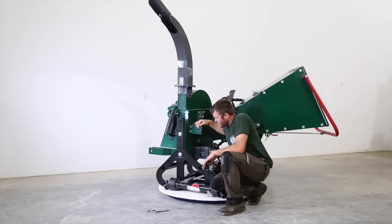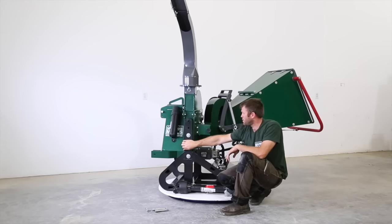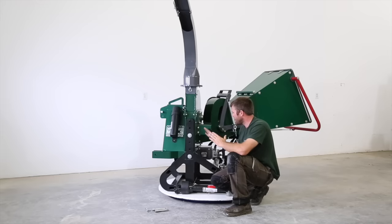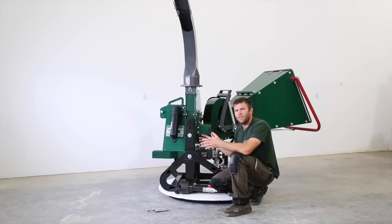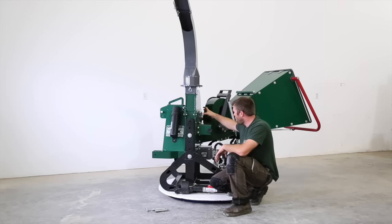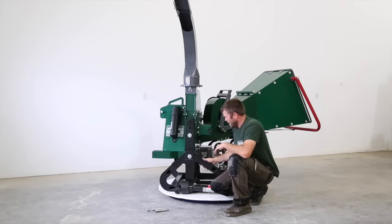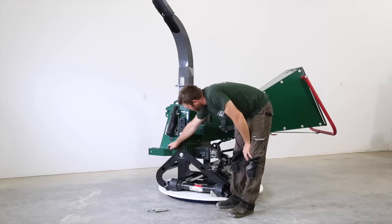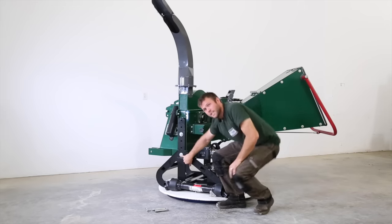The whole chipper was derived around the original concept of the double plate design. And through these double plates, we had all the cutouts laser cut and placed so that all the pieces pass through the laser plate. So everything's self-aligning in our manufacturing process. The bed plate, the infeed holes, and all the bearing plates are all laser cut on one machine. So it takes out all the errors and it also stiffens the machine up. This thick metal plate here for the 3-point passes right through both sets of plates and takes this lower bolt here.